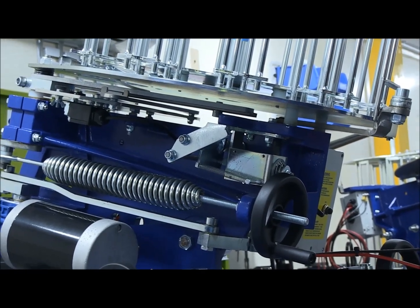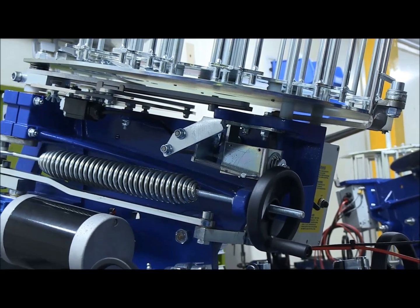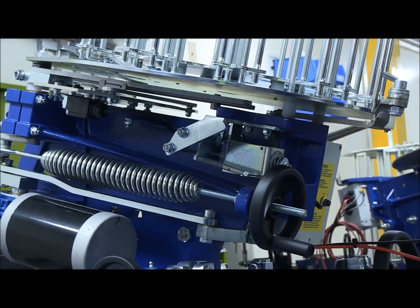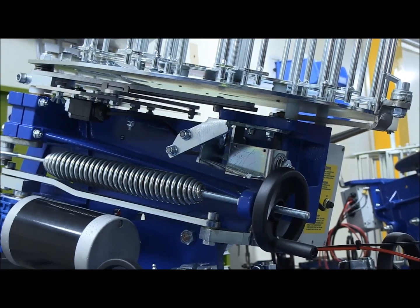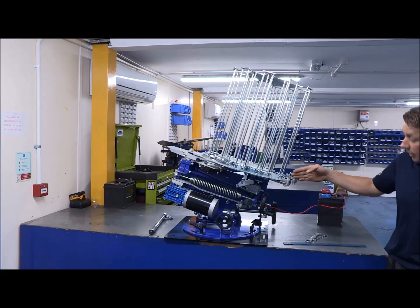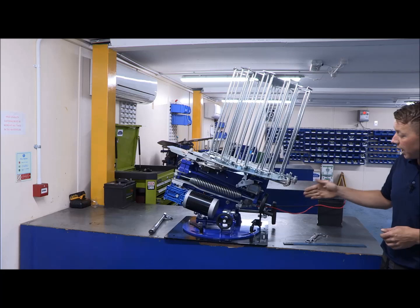So what's happening as it's coming round, the machine's firing too early and it's only the trigger that's holding it. Two things can happen here. It'll fire straight through, so if the machine starts cycling, because it's coming over centre too hard, it's basically firing straight through the solenoid. Or the other thing it could potentially do is jam up. So what we'll do now, we'll show you how to retime it all.